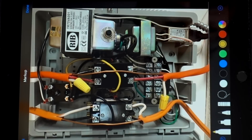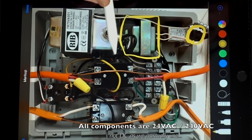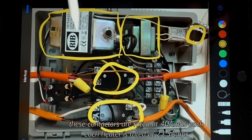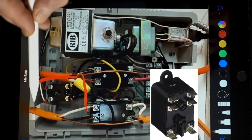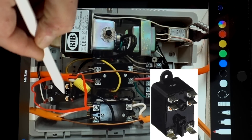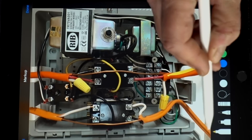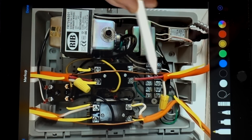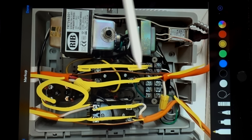Here's a picture of what's inside the box itself. At the bottom I have 120-volt power, which provides power to this transformer here — that one powers the Nest thermostat — and also this bigger transformer at the top, which powers the contactors right here, these two contactors. I wanted a bigger one separate from the Nest one, because I want these to actually shut properly to provide current. At the top we have a relay that is controlled by the Nest thermostat. When the temperature gets too low, the Nest thermostat activates this relay, which activates each one of these contactors to close the circuits. The power comes in from the panel, gets cut here, and continues to the actual heaters. The ground is not cut. When the relay activates, it closes the circuit and the power can continue to the garage heaters.